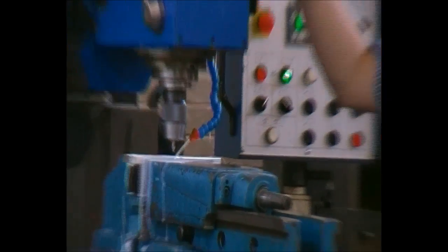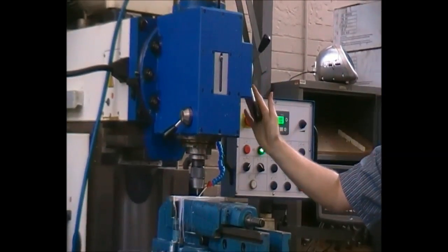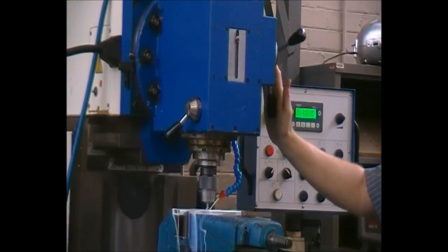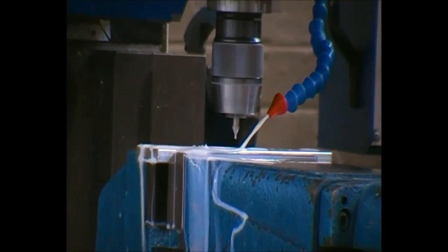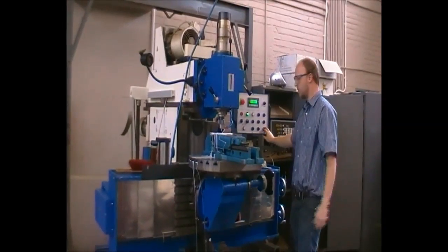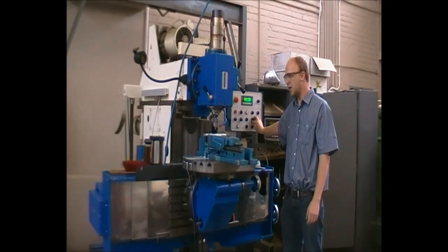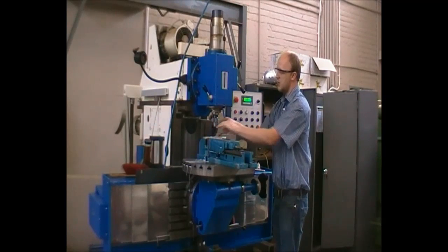The milling machine also has a drilling effect — it locks on the side and then uses this handle to plunge down vertically. We do not use the center drill for actual drilling; rather we use it just to make an indentation so the drill we are going to use afterwards does not drift in different directions. The center drill hole has now been drilled, whereafter it will be followed by the necessary drill bit.